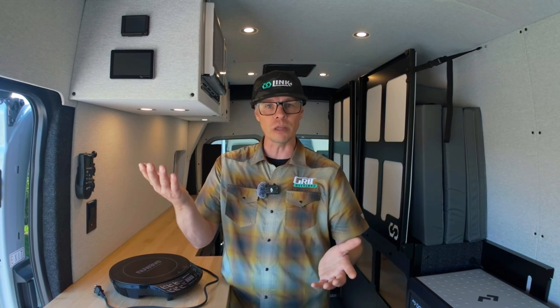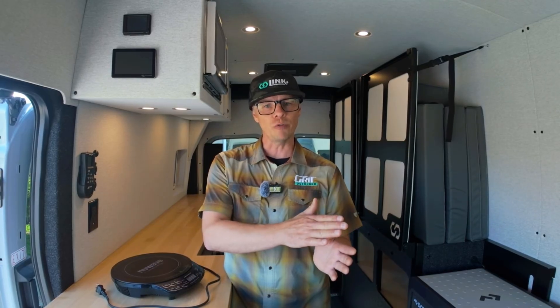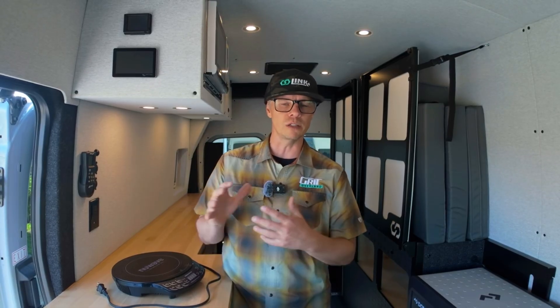We usually figure around 12 to 15 percent. That energy loss typically doesn't get reported anywhere on your screen. So be aware: if you have two devices each pulling 1500 watts, that actually will be over 3000 watts when combined. If you run them at the same time, it may be more like 3300 watts. If you're seeing that happen in your van, you should be aware of it and may need to take turns with those two particular devices. As a rough rule, you're going to be about 10 percent over what the device says or what's being reported on your screen.